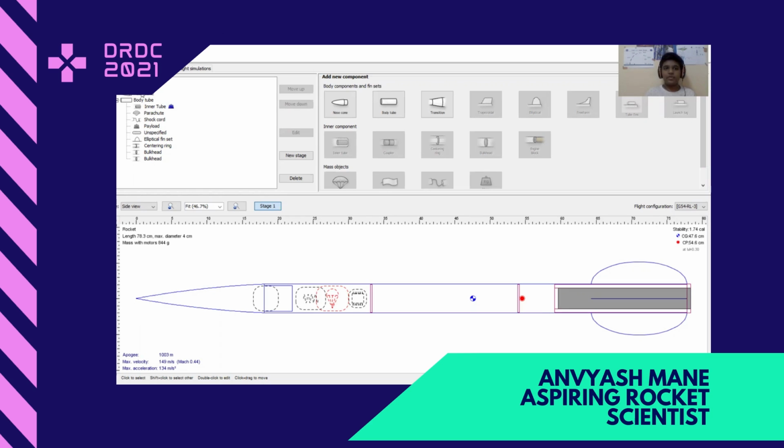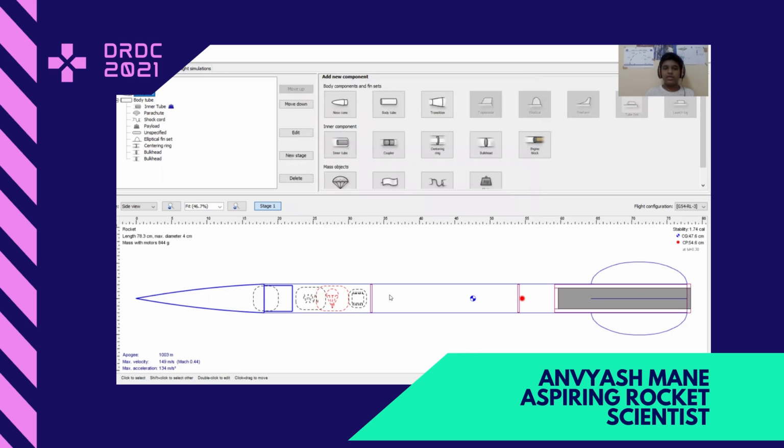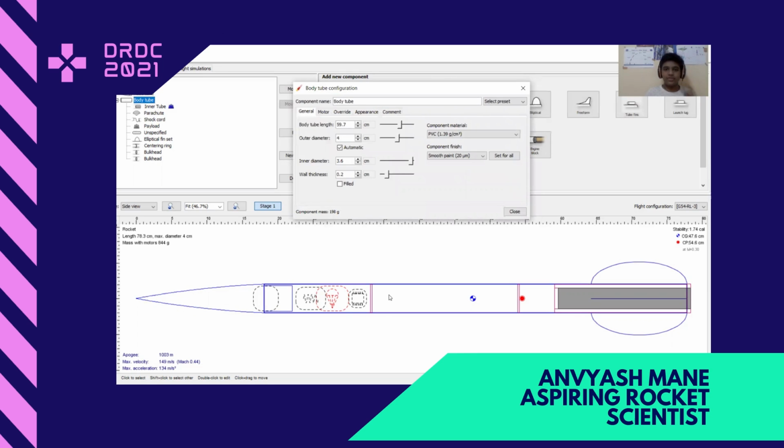After that, coming to the nose cone, the shape parameter is 0.75 as ogive gives more surface area and increases the drag and pressure. The nose cone length is 18.1, base diameter is 4, wall thickness is 0.2. I have used polycarbonate as I have experience with it and it's very durable. I have set the whole rocket to polished paint as polished paint gives less interference drag.